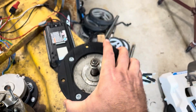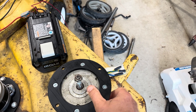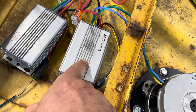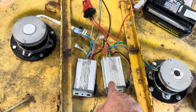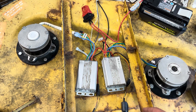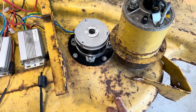It's very small, not a lot to it. It's got a shaft that spins and then it's got three wires that come off of it. To make that work, it does need a separate dedicated control module, which is already in the lawnmower. I salvaged these two brushless motors and these two brushless motor controllers from some inexpensive used push mowers and put them into this 50-year-old mower deck.